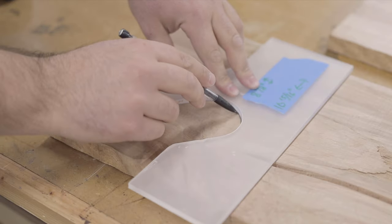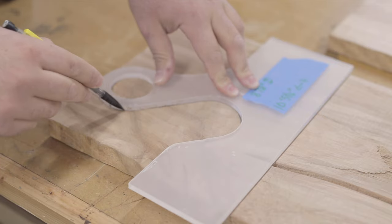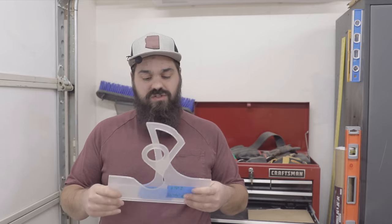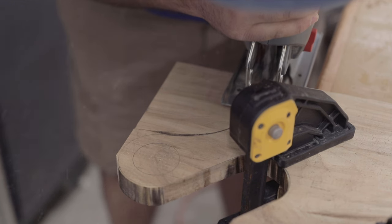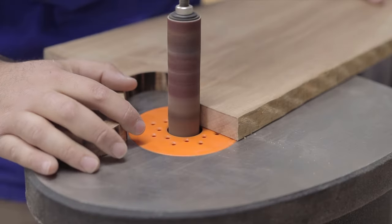This next part is going to generate a lot of questions, so I'll get in front of it. These are the acrylic handle templates I used to trace the handle designs onto the charcuterie boards. I did not make these — I purchased them from Jeff Mack Designs, and I'll link his website down below. You can get them as just a tracing template to trace onto the piece and cut out with a jigsaw, or as a router template that's thick enough to actually follow with a router. Once you've got your handle traced onto the workpiece, I used a jigsaw to cut it out and then a spindle sander to remove any burn marks and smooth out the curves.